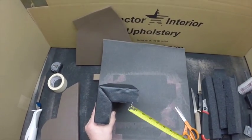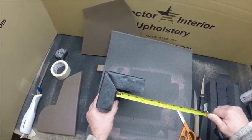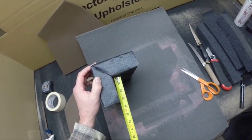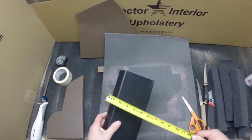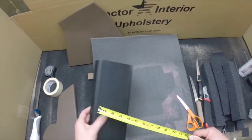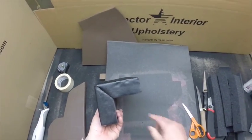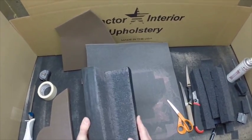You also have to keep in mind that if you're going to put this in a cab, you have to consider that you're only going to cover a little over 3 inches on the inside, or 3 inches that direction, but you've actually started out with a 5 plus 5 plus 2 plus 2, 14 inch piece, and you're only going to cover like a 3 inch tube if it were in here. So you're going to add quite a bit of material for these rolled edges.